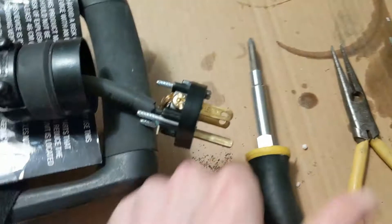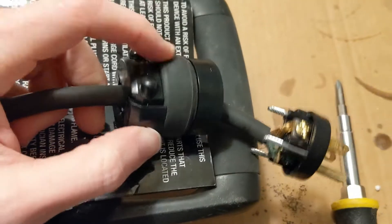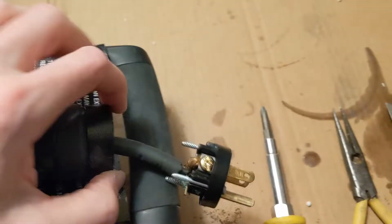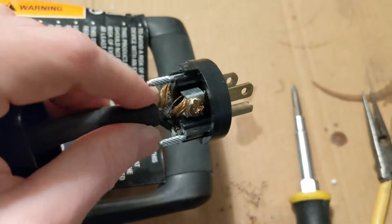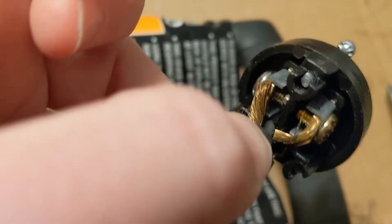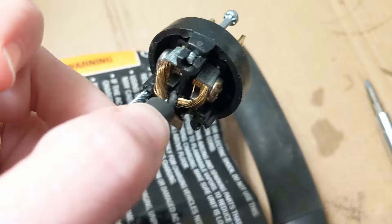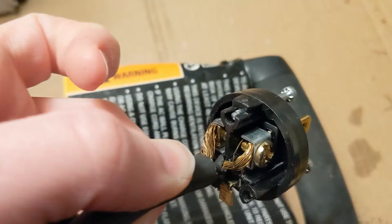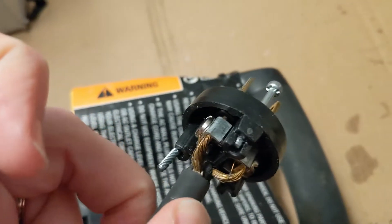Basically you open up this plug with a screwdriver — you can see it's pretty simple, there are a few screws. On the back you have to put the shield — or whatever you call it, the case — on first, loosen it up, slide it onto the wire. Run the wires in, then loosen up these screws on the inside, and you just put the wires down in the different connectors and it'll crimp in there. It's probably hard to see but you can see it's actually being crimped between a couple of spots.